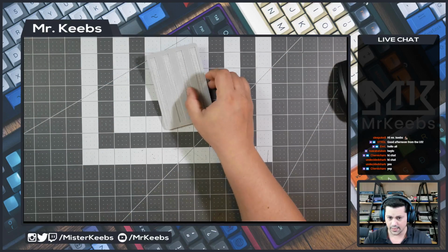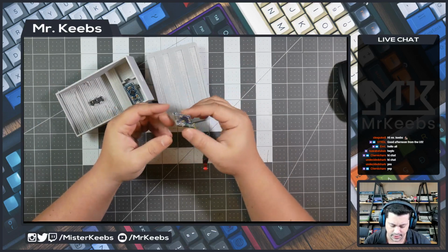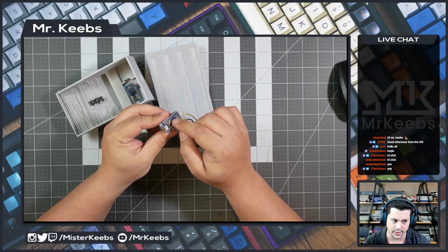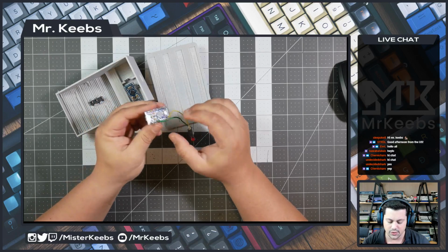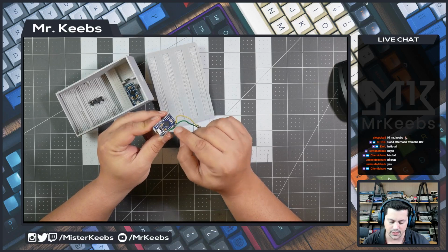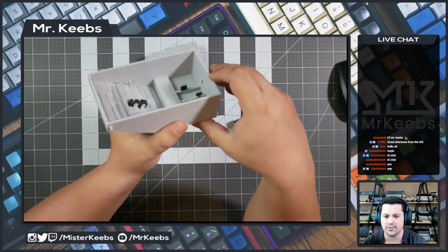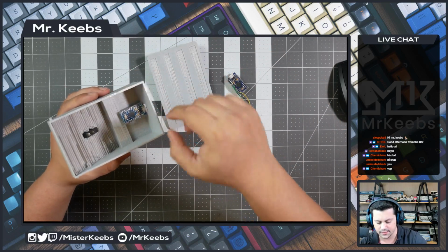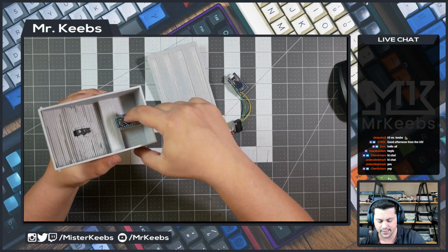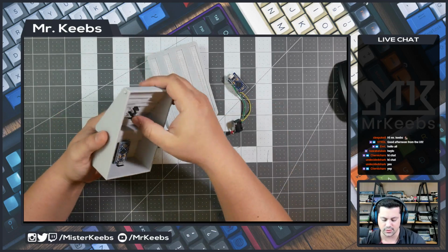All right, so I don't know if you guys know about this. Let me show you guys. We have this pedal here. And yesterday we used this Pro Micro here to program, and we created a little program for the Arduino that basically sends a command over the serial port every time we click the switch. So today I'm gonna desolder this cable. And as you can see, I printed a new case that allowed me to put those kind of standoffs that we have to put this Pro Micro here. So we're gonna put it there like that. And then we're gonna solder that in place in a way that we can then connect the cable here. And we're gonna see if that works using this switch instead of this one.